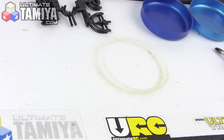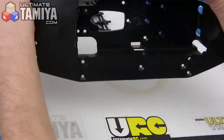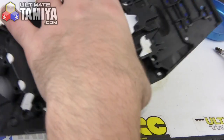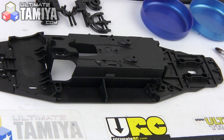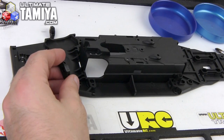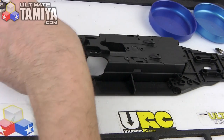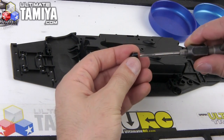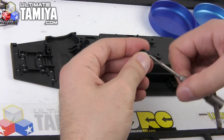That's an assembled transmission right there. Now I'm going to pick up the biggest piece of all — the chassis. This is a fairly flexible piece; it's fiber reinforced but has some pretty soft nylons in it. It will all get stiffened up as things get assembled. I'm going to work on the rear first because I need to get that transmission attached, but there's some prep work first. I've got a couple of pivot blocks that are going to go back here to receive the front end of the suspension pins — the inner pins. These are fairly high-fiber plastic, so I'm going to pre-tap them this time, learning from that prior experience.